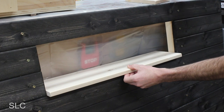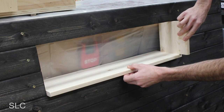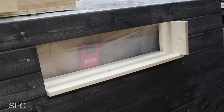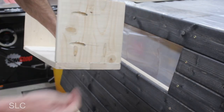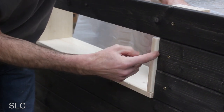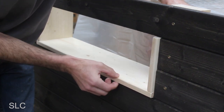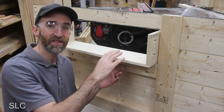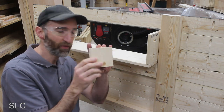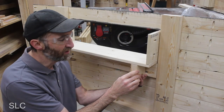But these sides look kind of rough. So I decided to make a couple of similar side pieces with the same design as the main shelf. Once everything's in place, I think that'll look really good. To hold the sides onto the base, I again used some pocket screws. When I installed this shelf, I'm going to leave it sticking out about a quarter of an inch — that'll cover up all these rough edges and I think it'll just frame it up and make it look a little bit better. But the back is a little more tricky because there's not much support on the back for the shelf. So I'm going to take some two by fours cut down to about three and a half inches and attach them to the cross brace to give support to the back on each side.